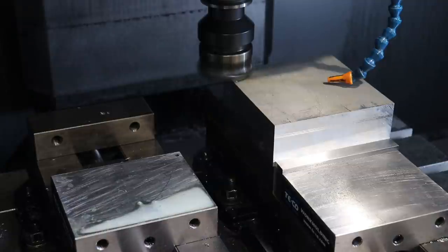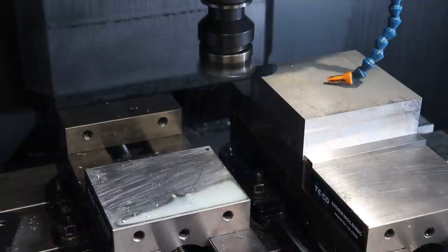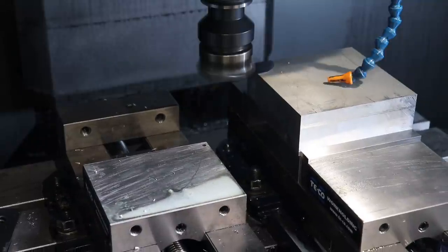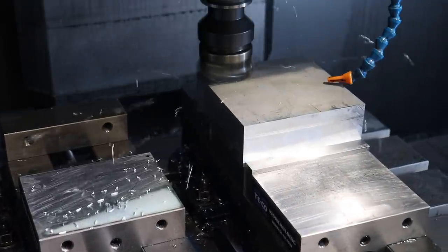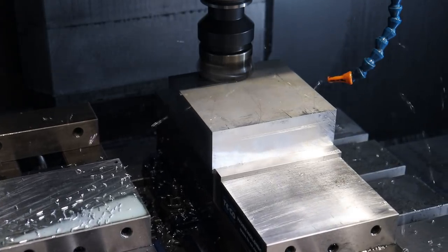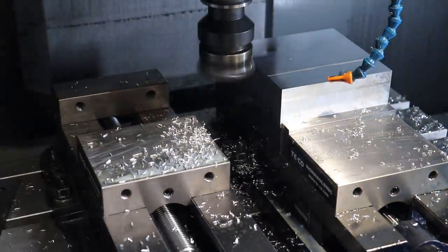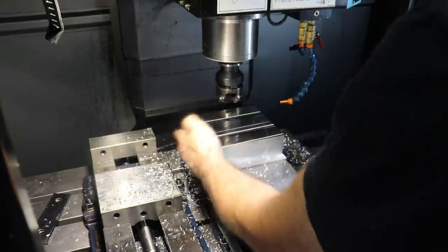There we go, they're retouched. We'll move off in X, and then we'll drop down another 100 microns or so. Then I'm just gonna hold down the jog button. So I'm moving Y first to get a decent exposure, and then go across. Sounds like we started the finish cut on the Haas mill over there. That was that change in RPM. Okay, so now what we wanna do is find a corner on this aluminum block.